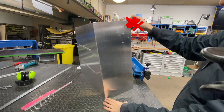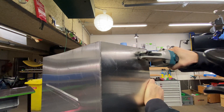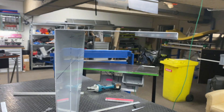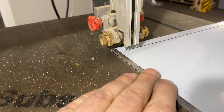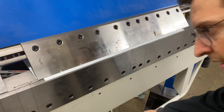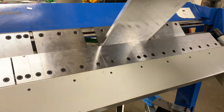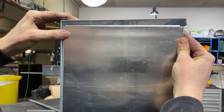There's just one thing I forgot: if I want to rotate the whole box over, this corner sticks out. So I need to cut these corners off. If you want to cut out the bottom I recommend doing it at the end so you can measure exactly the right dimensions. This is 25.6 wide. The bottom will be shaped just like a pan and I'm notching out the corners so I can bend up the sides. For a pan like this you need a press brake with removable teeth. I made a little mistake - I cut it about five millimeters too short. So let's do it again.